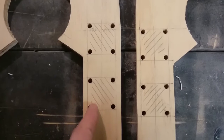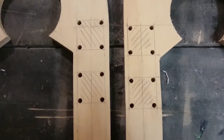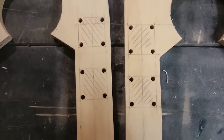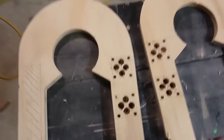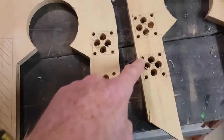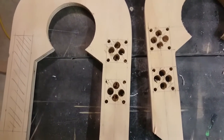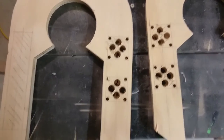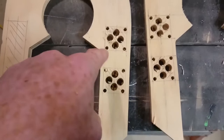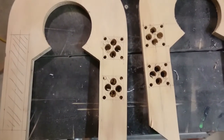There's a good chance, especially down here, that this will break as you cut through. I'm hoping it doesn't, but if it does, I'm just going to have to either glue the piece back on or cut another one and start again. I've drilled a series of 10mm holes - or 3/8 holes if you're using imperial - just to make it easier when I cut it with a jigsaw. I'm going to cut from there to there to drop the inside out, then cut tenderly with the jigsaw all the way around as gently as I can.